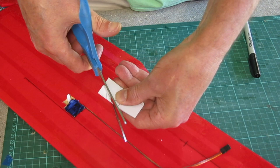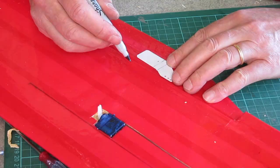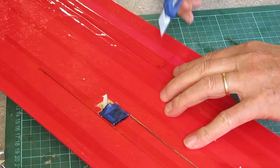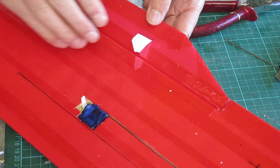This is ID card plastic for the control horn. I'm drilling holes of the right size to fit the linkage adjuster. Now marking where the control horn is going to slot through — just cut a slot in the aileron — and pushing the control horn through from the top so that it pokes out the bottom.